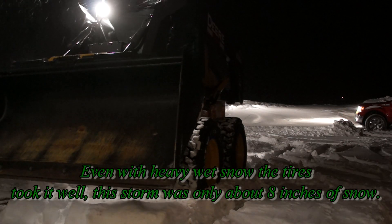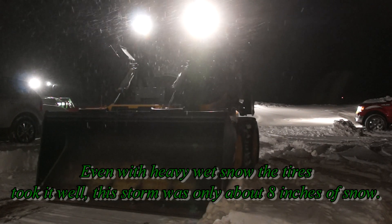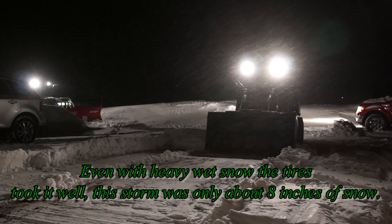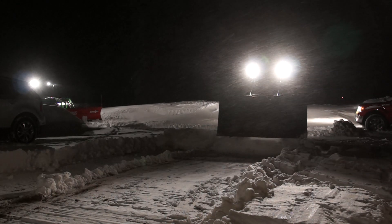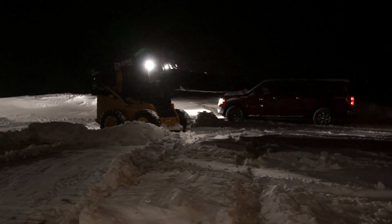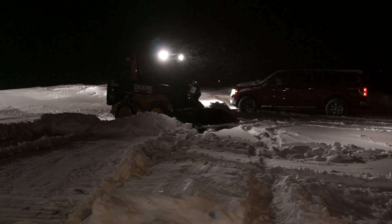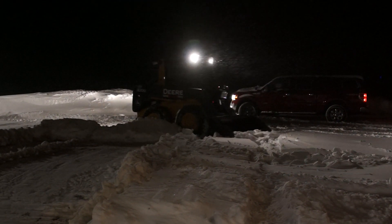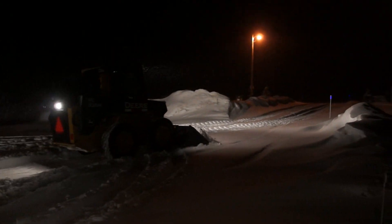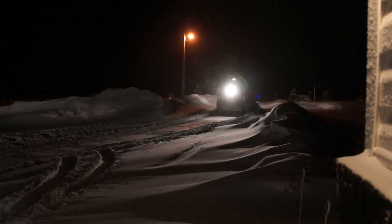You can literally grab into the wet, heavy stuff, and in this case we're even pulling backwards, which is notorious for getting a skid steer to break free and slip and really spin its tires. But it's doing it almost effortlessly, which is what we wanted with these tires. I think the deep lugs on these things really help bite into the snow. And with the snow even being wet like this, it seems to be able to clear them quite well. We did have these tires out on some mud and clay just to try them out, and they don't like that quite so much — that will actually cake up the lugs and cause it to spin more.